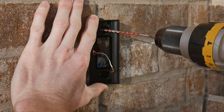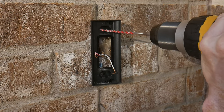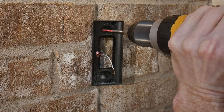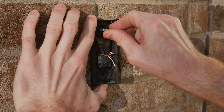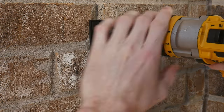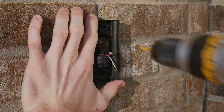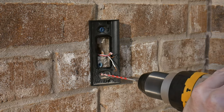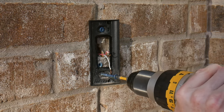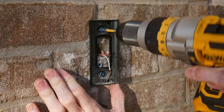Using the wedged mounting plate as a drill guide, I drilled a 5/32nds of an inch hole into the concrete with a masonry bit. I felt like these 3/16th of an inch concrete fasteners from Lowe's are a better option than the provided hardware. After getting the top hole drilled, I'll get the top fastener started so that the bottom hole is spaced out appropriately on the wall.